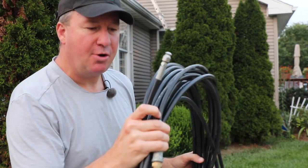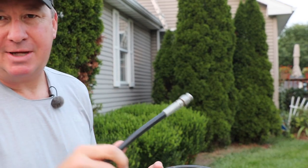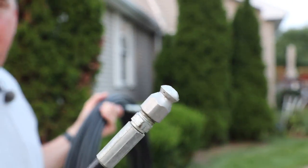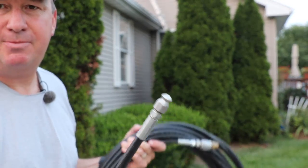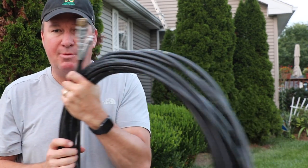This right here is a 100-foot jetter hose that hooks up to your pressure washer. It shoots one jet forward and three jets back. So in case your daylight drain ever does clog, you hook this up — this end goes to the trigger part of your pressure washer, and this end goes into the daylight part where the drain comes out of the ground, and then it just feeds itself in. It's amazing the power that comes from this. I haven't seen these in stores — I had to order it online, so I'll provide a link below.